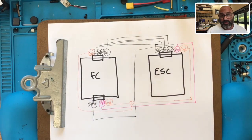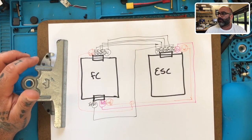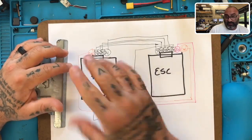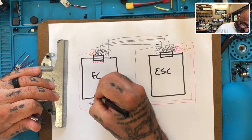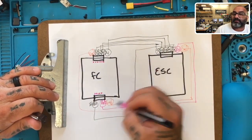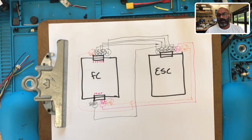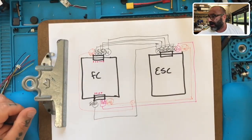That is how you connect this board to an ESC that isn't the same brand but will still work just fine. The other option is if you have pads and want to direct solder, but after looking at the picture I don't think that board has pads - it's an F20 board with very little space. If you had pads like on the flip side, it would be easier to solder directly to the pads for a much better connection. But if you don't have pads, follow this method and you're golden. I hope that helps - I don't have both pieces of equipment here but I promise if you follow this it'll work perfectly. Let me know if you have any questions, god bless, be safe, and we'll see you soon.